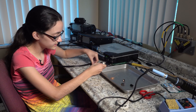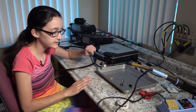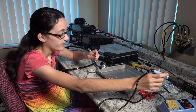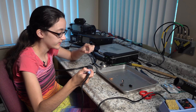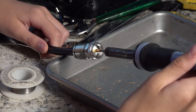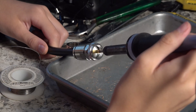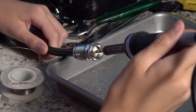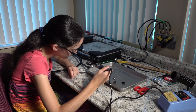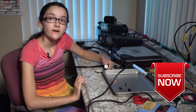Next you would want to solder this. This is only my second one, so hopefully I'll do this right. You'll take the solder and tin the iron, then place it onto the connector. You want it to get heated up so the solder flows in, but you don't want to hold it on so long that the copper gets really hot and melts the dielectric. It's soaking up now — so that's good. And that's it.